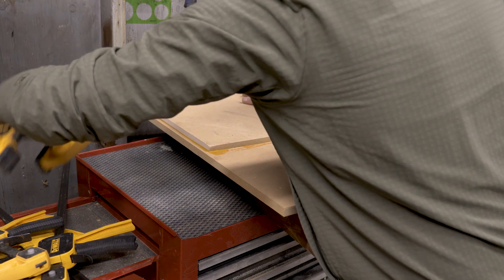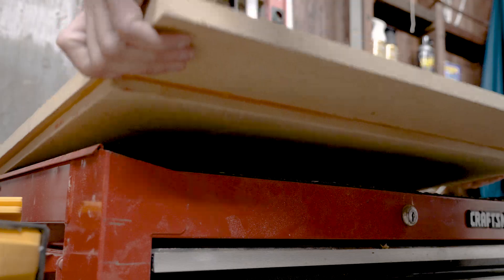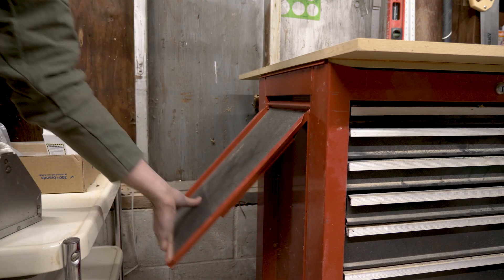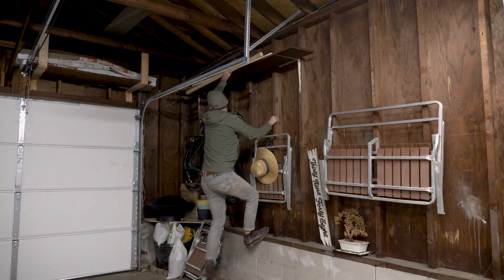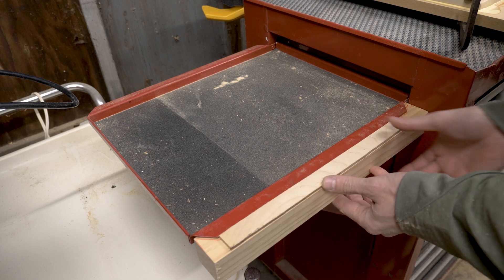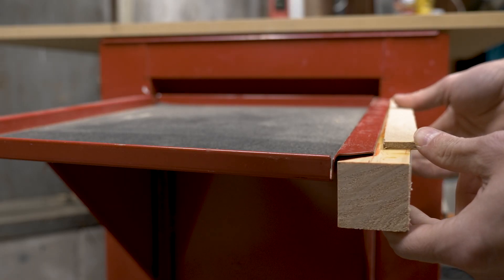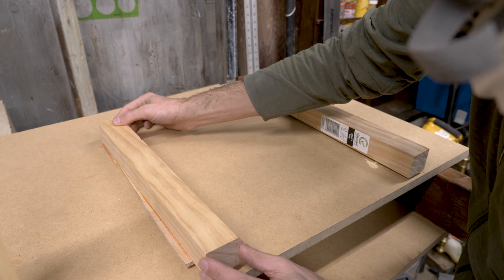I then Jackson Pollocked it to a larger piece of MDF. Once dry, the smaller piece nestled perfectly into the toolbox and held the large piece in place. The miter saw table was built on the little fold-out tray. To make this work, I grabbed a 1x1 and an eighth-inch piece of plywood, which I fashioned into a sliding mechanism that'll keep the table fixed to the fold-out tray. I glued those onto a piece of MDF, and once dry, I slid it off.